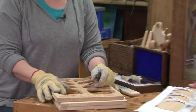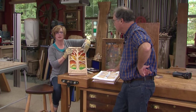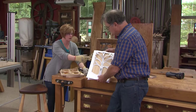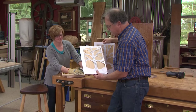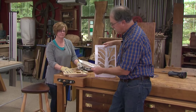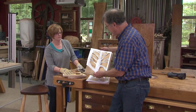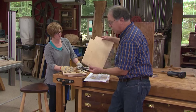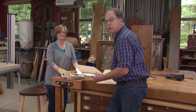Let's talk about some scroll saw ideas today. I'm doing a 3D scroll saw project that uses a series of knives to carve. We started with my pattern here. That's the top pattern — basswood, half inch thick — and it works with a pattern that's 11 by 17, nice and big. Three layers. That's the middle pattern, again half inch thick basswood, and a backer board that could be plywood or solid wood.